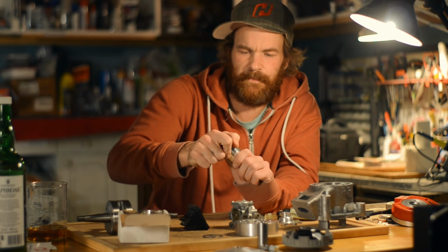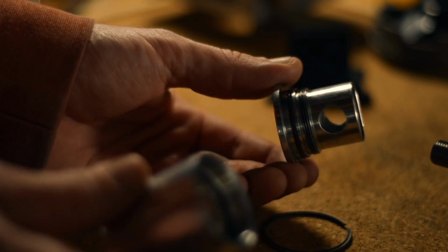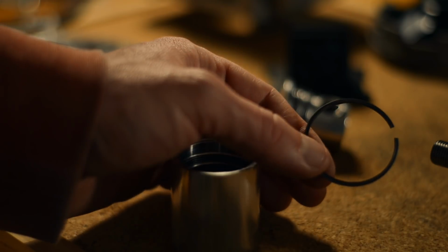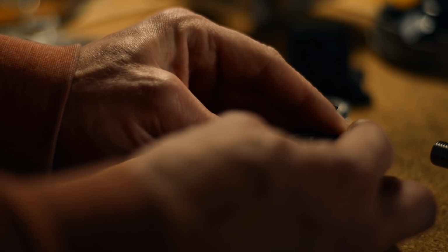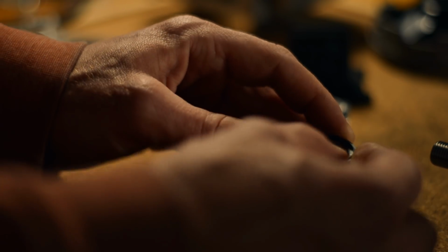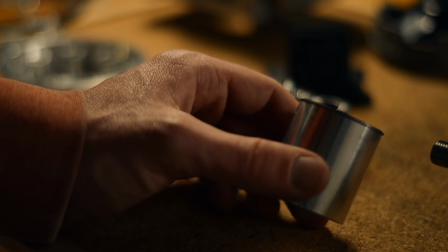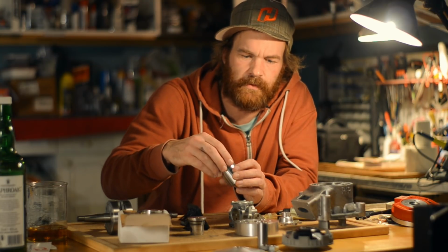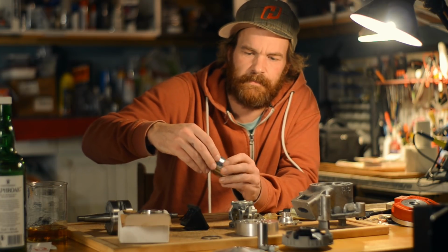which Mark Atkinson kindly made for me. It's his design too. This special stepped ring that's retained inside the ring groove, and it's not allowed to move more than about 10 thousandths outwards. So it should be able to seal without being able to snag in a port. That's the theory. Not tested yet in my engine, at least.